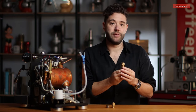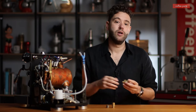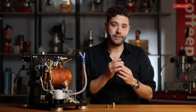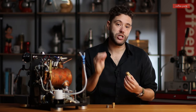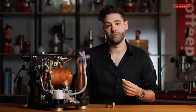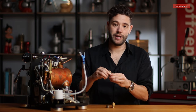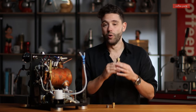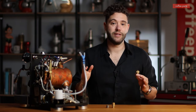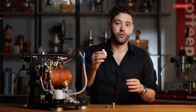Safety valves come in multiple thread sizes — some are one-eighth inch, some are quarter or three-eighths inch BSP. They also come in certified or non-certified versions. The certified ones are pre-adjusted to a particular pressure setting, which some countries require. With non-certified ones you can turn the adjuster to bring the release pressure down or up. If you're installing one of these, you should be a qualified technician who knows how to calibrate them. They also sit on top of the machine.